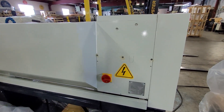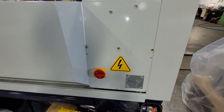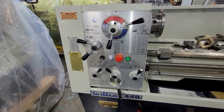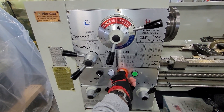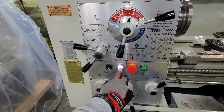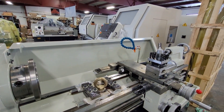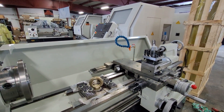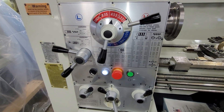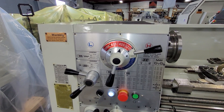This is the electrical control box that is on the machine. Once the machine is hooked up with power, this is your main switch right here. We'll turn that on. With the main switch on in the back, we'll make sure the e-stop is out. This will show you that you do have power now at the control panel. This is the flood coolant on-off, and you can see that's plumbed up to the back of the carriage — it also has a valve up there. This button here is the jog button, which you would use for changing the spindle speeds, because you do not change the spindle speeds when the spindle is running.